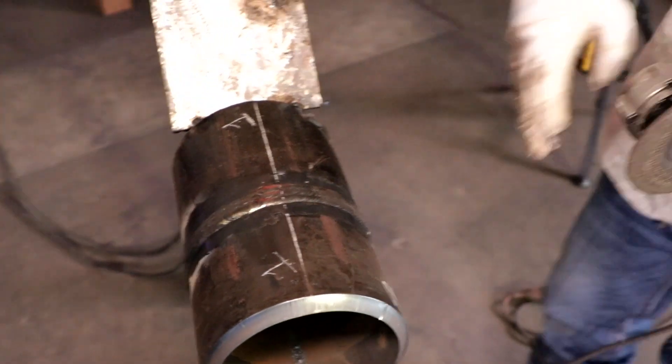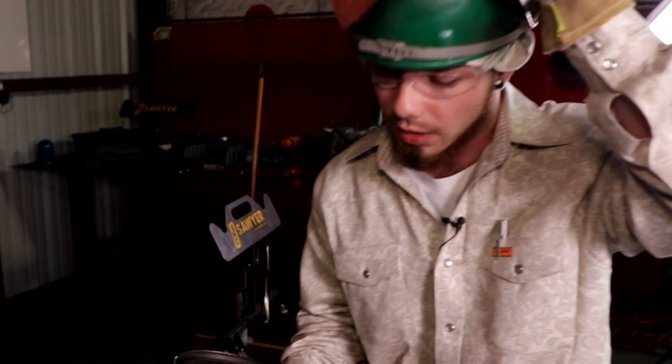Now I've taken my cap here pretty flush. One thing to always keep in mind is you don't want to have your grinding marks go to the pipe. Also, you want to make sure that you're not trying to repair a whole quarter of the pipe — you're only trying to take out that little area. So you take out just as little amount as possible to make the repair. Now that I've got it flat, I'm going to start digging in and trying to keep out an eye for the indication.